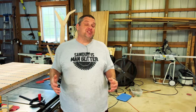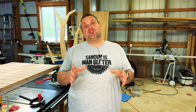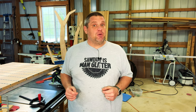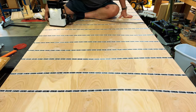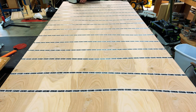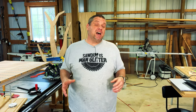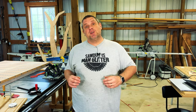So now that we have our Shaper Tape laid down, we need to scan our workspace. This is where the Shaper is going to take a picture of the entire sheet of plywood and those dominoes so that it knows exactly where it is when it's making its cuts. The Shaper is simply taking a bunch of pictures of your workspace and stitching all those pictures together using the dominoes as reference. Once the Shaper has created a workspace with all these images, it's now time to download the SVG file of the tree that we want to create so that we can place it onto this workspace.